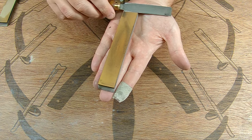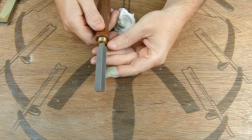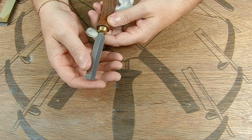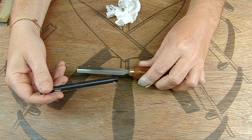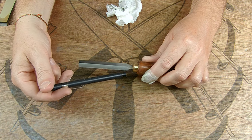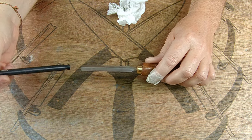Pushing away always puts the burr on the front face of the blade. We've got again that very thin line at the corner and the very thin line at the edge — this is sharp, it's got a bite. We're going to check our edge using the edge tester: nice and smooth, no real bumps. If there are bumps and they're consistent all the way along, you're still consistent — depends on the grit. At nine micron, or 2000 grit, you're pretty good. So that's nice and smooth and we're going to finish it now.